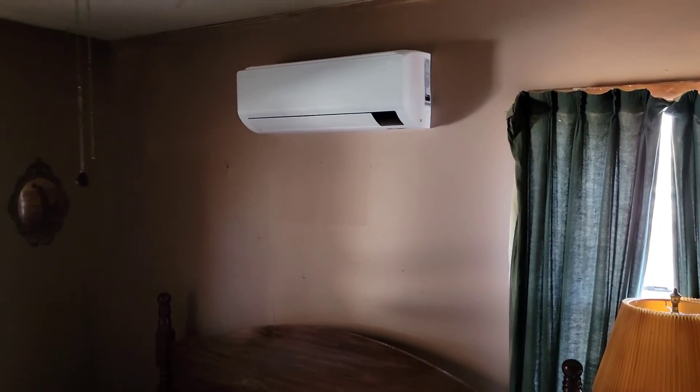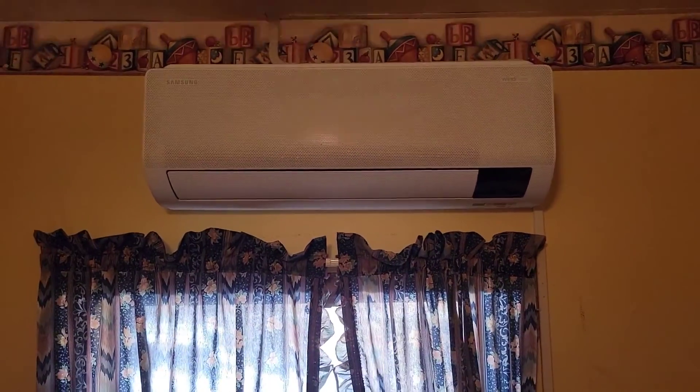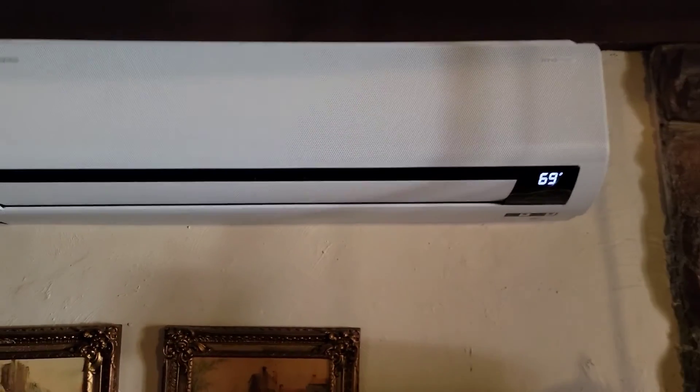Here's one bedroom with one 7K head — another 7K wall mount air handler in another bedroom. Here's the third wall mount air handler — Wind Free. Love it. And here is the single zone 18,000 BTU in the main living area — it's already running and heating. So far we've got a lot of progress made and the homeowners are very happy. They said it's already so warm in there from that 18,000 BTU mini split. The next process is getting more line sets installed for the indoor heads, installing line hide and covers, and then tearing out the old package heat pump and duct work to install the outdoor unit for those indoor wall mount air handlers.